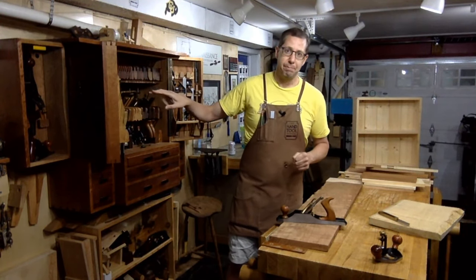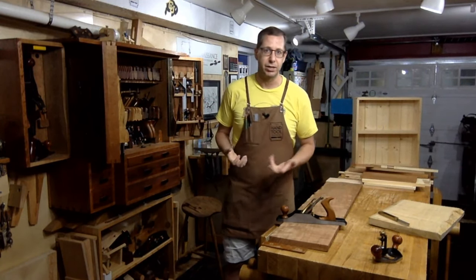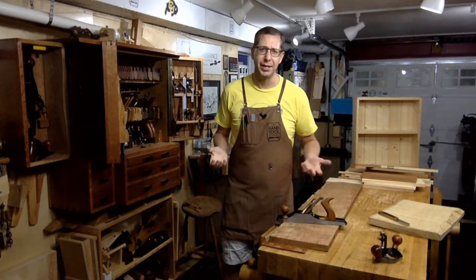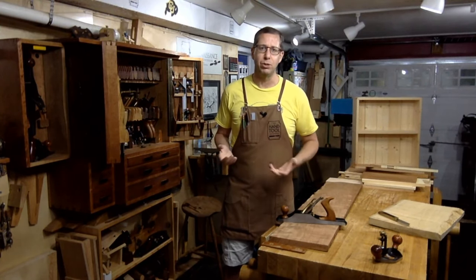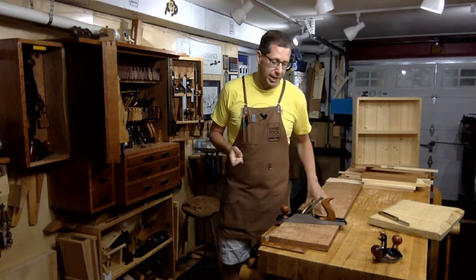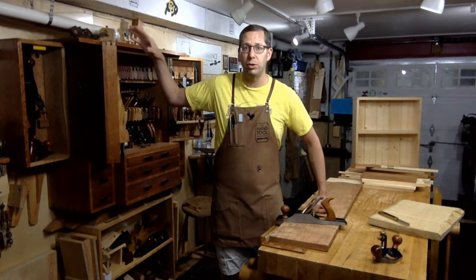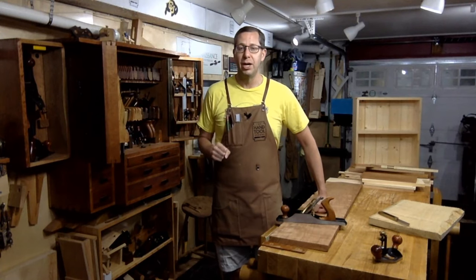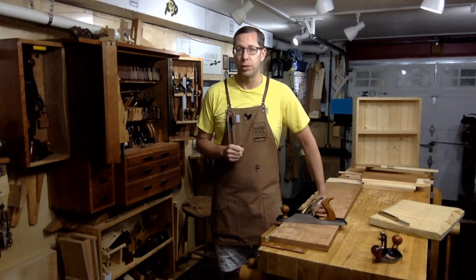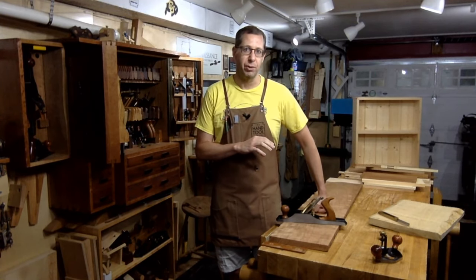The jointer plane, say you've got your jointer plane set to take a 5/1000 of an inch thick shaving. Don't say you've got it set to take a 1/1000 of an inch shaving, because what are you doing? Seriously, are you trying to split an atom with that level of flatness? That's just ridiculous. If you flatten a board to 1/1000 inch thickness tolerance over a 22 or 24 inch jointer plane surface, walk away for an hour and it won't be that flat an hour later, because the board is going to move more than the tolerance that you just set for it with that jointer plane.